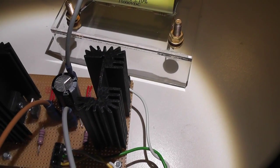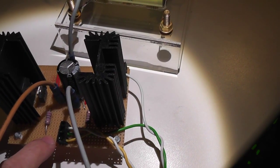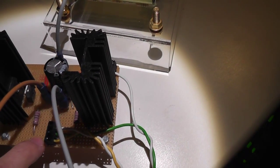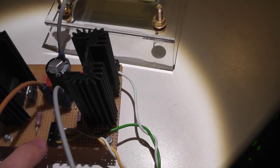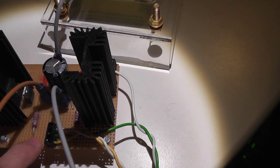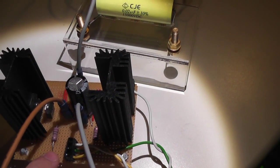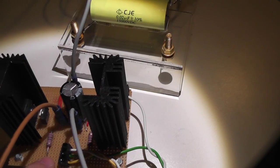Here you see the output. The important part is: in this scenario, directly connecting to the load will not work — it will burn through right away, you have almost a short in the network, or you get nothing out at all. Both scenarios are very frequently happening and you can read about it on a forum — everybody suffers from this kind of problem. The solution is first of all to implement the dead time, but the second and much more important scenario is adding a matching LC series tank.